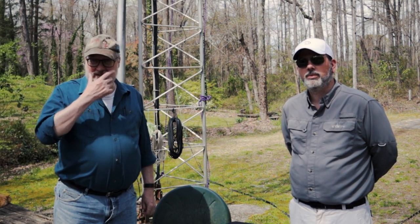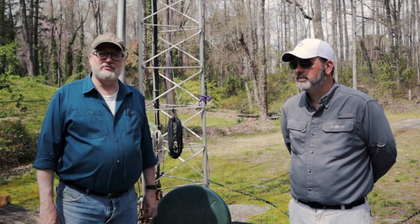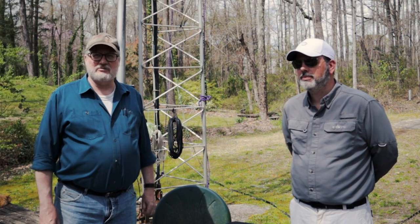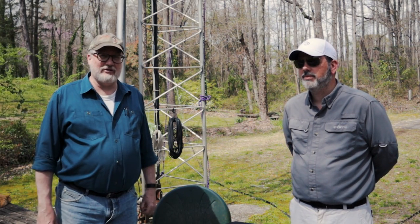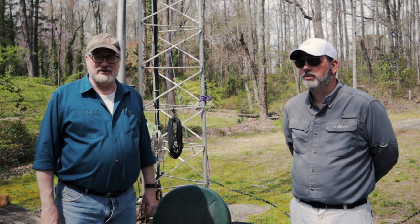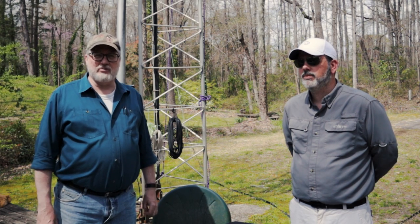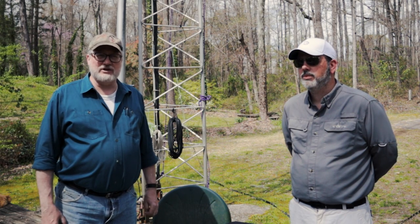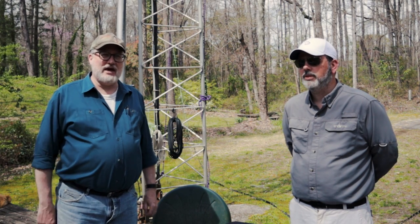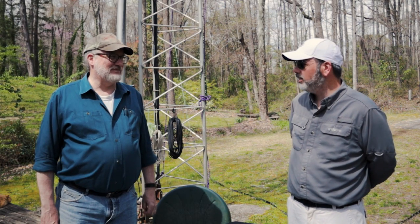Now, you might say, well, wait a second, I already have a G5RV. Well, if you do, you should probably take it down. The G5RV was designed originally by an Englishman, Louis Varney, G5RV, to be a 3/2 wavelength center fed antenna on 20 meters. The pattern was such that it reached all the points in the British Empire that he wanted to reach. He never contemplated that it would be a multi-band antenna. That was American marketing genius at work. Because it is not a multi-band antenna.